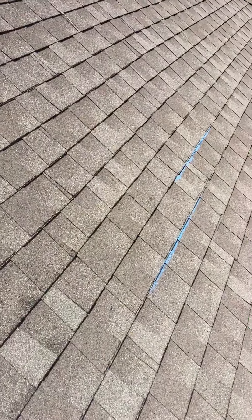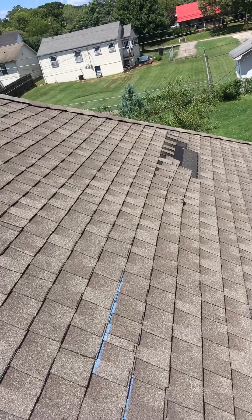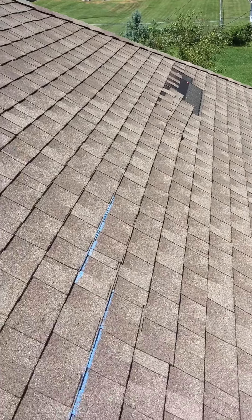The roof's not very strong this way, and you can end up with one union in line with another union below it, which is obviously probably where you'll see the weakest portions of the roof and examples of issues where the shingles are blowing off.